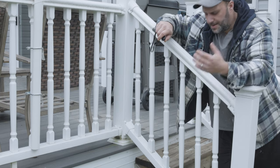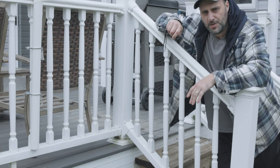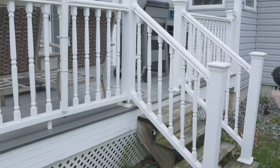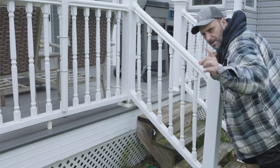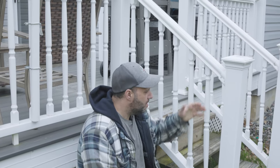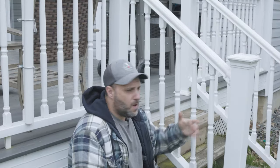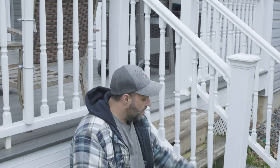Here's a railing system on my deck that I'm going to rip out within the next month or two, so we're just going to use this for the demonstration. To get that sweet pitch with your railings, the first thing you need to do is figure out how many cables you want. With this length I'd probably go at least five — with thicker cables maybe four, thinner cables maybe seven.